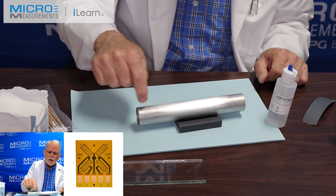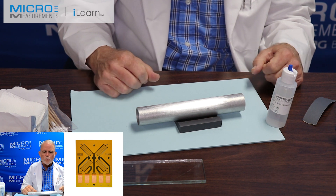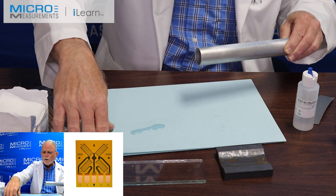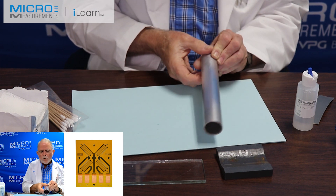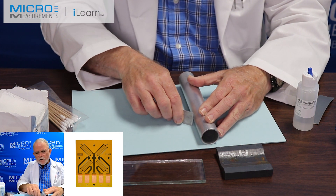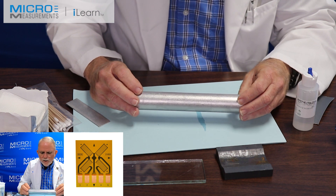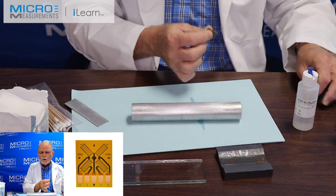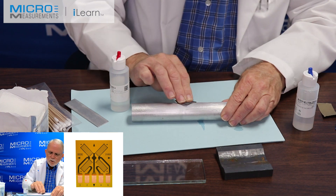Now we want to establish a line that is perfectly linear along the length of the tube so that we can align our strain gauge appropriately for measuring the shear strain or stress. I have a technique — I used to call them tricks of the trade, but there are no tricks in strain measurement, there are techniques. I have the surface prepared area where I'm going to put my burnished alignment mark. I'm going to hold a straight edge down on the surface and take a soft metal part — another piece of aluminum — and run it down the length of the tube. Then I'll go back to my 320 or 400 grit silicon carbide abrasive paper and abrade it radially around so I can see my burnished alignment mark.